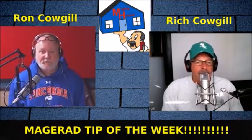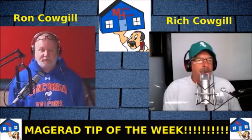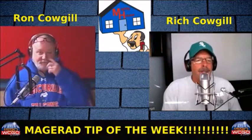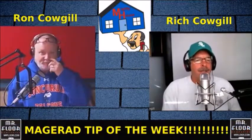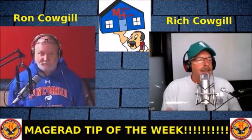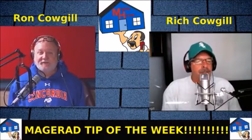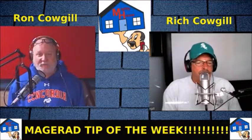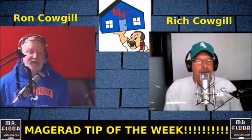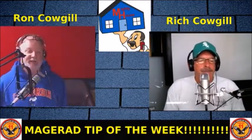One thing that always drives me crazy is copper pipe — you should be using Type L and people are using Type M. Most people don't even know there's a difference other than the price. Type L is $14 for a 10-footer and Type M is $9.76, so it's four dollars cheaper per half-inch 10-foot piece. But it's thinner, doesn't hold up as well, and it's actually illegal to use in some applications. They also have different color markings — blue is the one you want to use — though you have to sand it all off to solder it anyway.